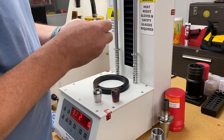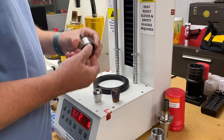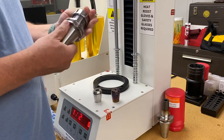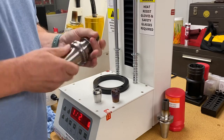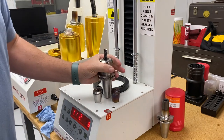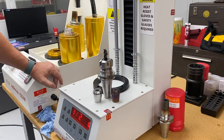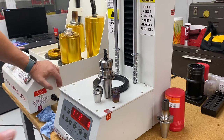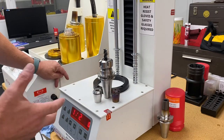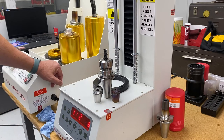The benefit of this tool also extends to milling machine applications, because not only do we get the grip force from the shrink fit, but we should also gain some vibration dampening from the nut and from the body. So not only was it intended for lathes, but we also see a benefit going into regular milling and Erickson-style chucks.